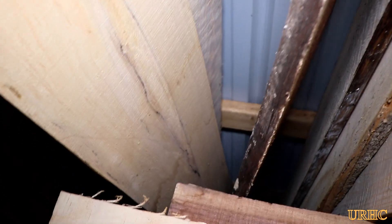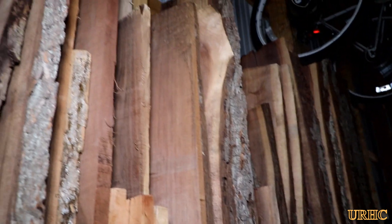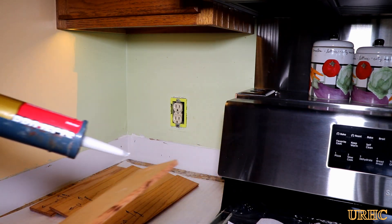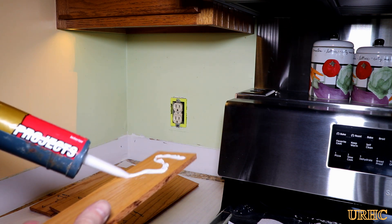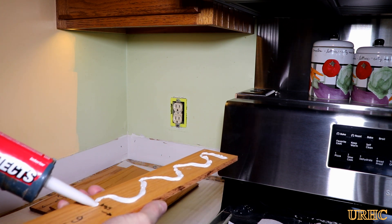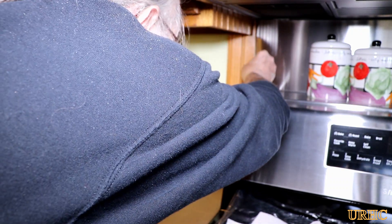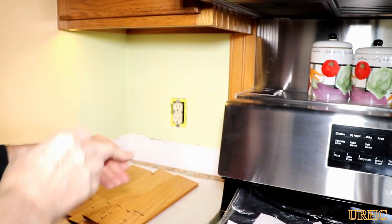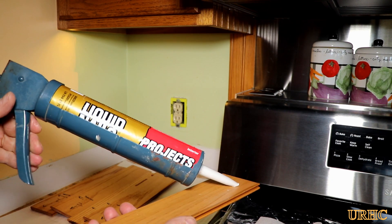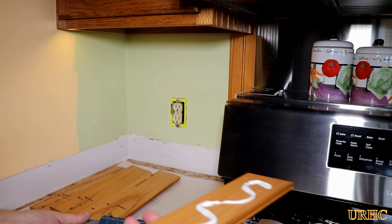I got that piece into the shop and started cutting it down for the other side. After everything had three good coats of polyurethane on all sides, I went back and used liquid nails latex-based adhesive — I'd had good luck with it before, it has essentially zero smell so my wife can tolerate it. It really does make the job easy when everything's pre-finished. I put a snake-shaped bead on the back of each panel and just pushed them up against the existing sheetrock wall.